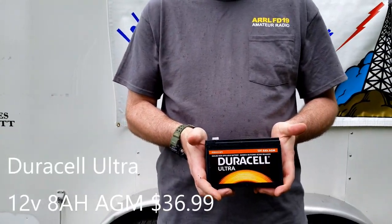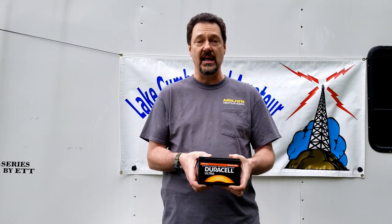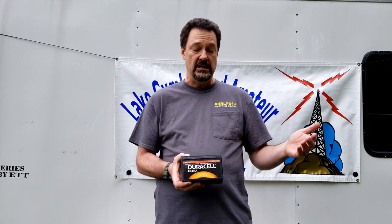Probably the most recognizable for ham radio folks is the sealed lead-acid battery. This technology has been around for decades, and we still use them. I still have one in my go box for QRP, travel, and camping situations. It's lead-acid, so it's not light, but it's a small enough form factor that you can take it pretty much anywhere. You can charge these, though you don't want them to get too low. A small rig like the FT-818 will get a lot of power from this. Chris has the FT-891 — you wouldn't run it at 100 watts on this battery for very long, but dropping down to 10 or 25 watts it's still usable. In an emergency situation, this is easy to put in a go bag — easy form factor, and again, off-the-shelf technology.